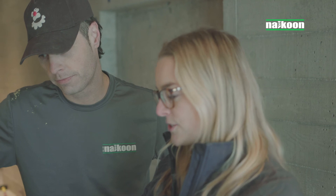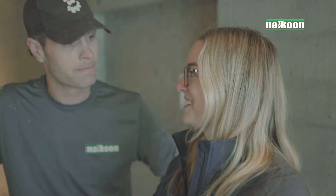We were aiming for 0.6 air changes, which is the Passive House standard. The results of our depressurization was 0.34, while the results of our pressurization was 0.32 air changes. That's great news — we're almost half under what we're supposed to be. Excellent, congratulations. Thanks, Emma.